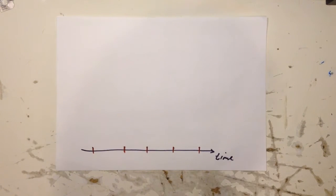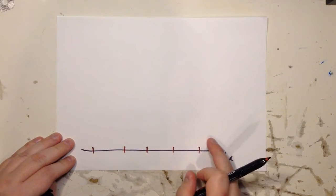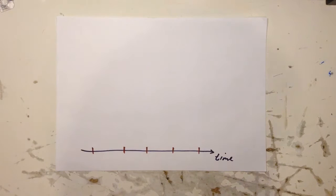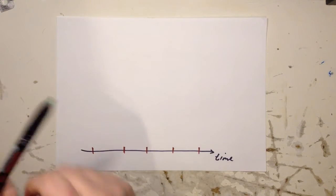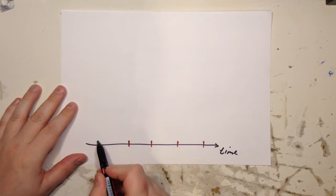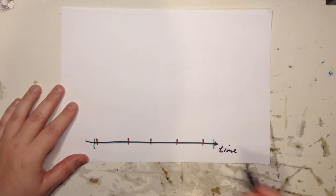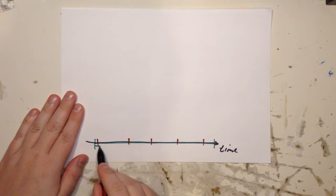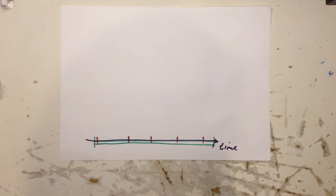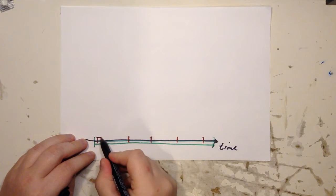So now the problem is, let's say you have to calculate something in this period. Let's say you have to calculate a big mathematical function, and normally, without the interrupts, it will take this long. Okay? So this is the time it will take to calculate this function. So maybe I should draw it here. Now, if your interrupt routine is full of code, the more code you have in your interrupt routine, the more time it will take, right?